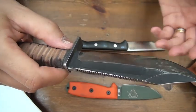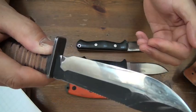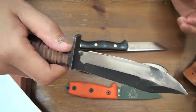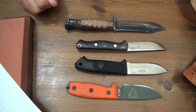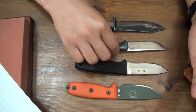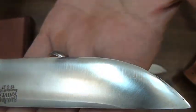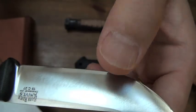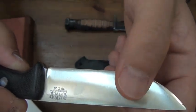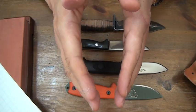This is zero grind, flat bevel edge - so to say, scandy edge, made by me. But more correctly speaking, it has my self-made deeper convex microbevel, very near to the edge, maybe 2 or 3mm from the edge line. So to say, convex is deepened at the edge portion.